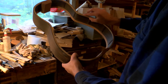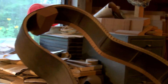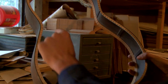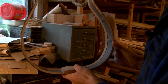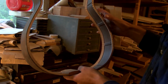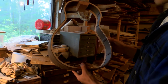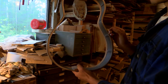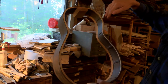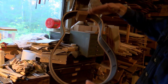got to put in kerfing, which he makes his own by just cutting it out, which is a lot trickier. I end up just buying some that's pre-cut, but you glue that around the edge, and that's what's going to help you hold the top and back on. So that's a whole other piece of wood that you're putting on there and then making cuts into. Yeah, you cut it beforehand, so that as you put it on, it doesn't just break as one piece of wood.